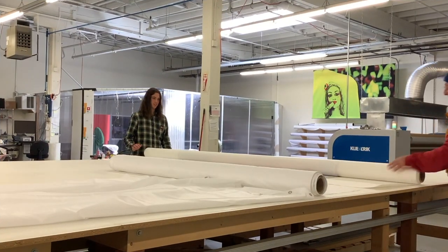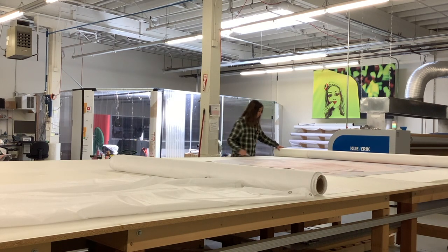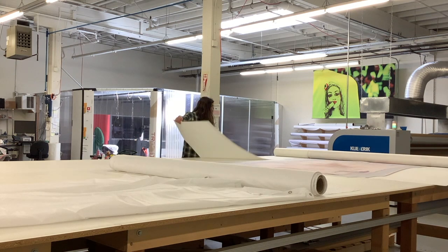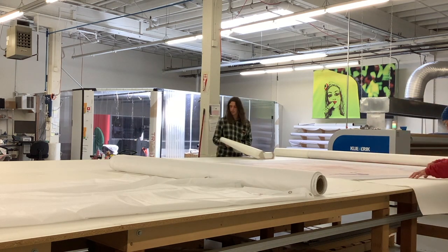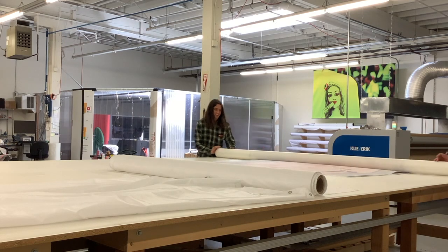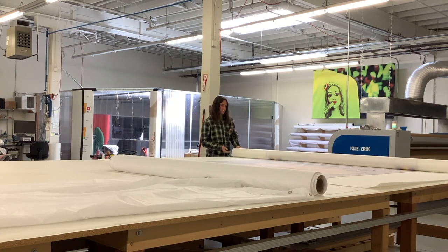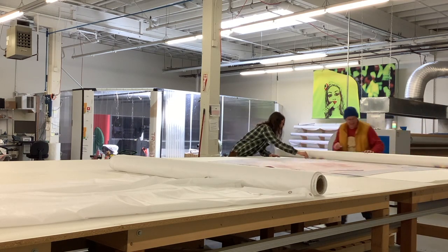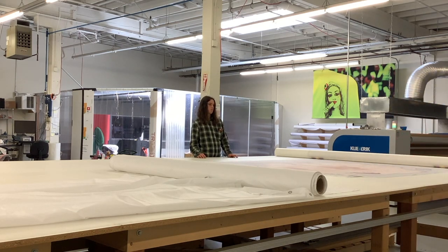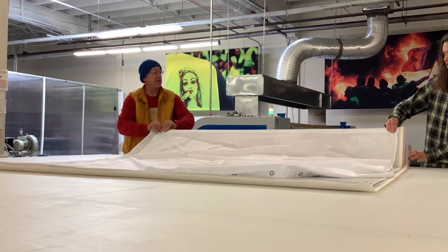After the printing is done, the huge heavy rolls of paper — ten and a half feet long — need to be brought over to this big table, where each piece can be cut out to be matched up with a shower curtain and printed in the dye sublimation heater. All this time I've been talking about dye sublimation, but I haven't really talked about what it is. It's kind of like evaporation, except evaporation is from a liquid to a gas — sublimation is from a solid directly to a gas without melting. For example, snow in a place that has a dry climate disappears without melting, because it's sublimating. The dry ink sublimates to a gas off of the paper when it's heated in this heater that you see on the right side of the frame. The ink, which is now in a gaseous state, penetrates the fibers of the polyester and creates a permanent result.